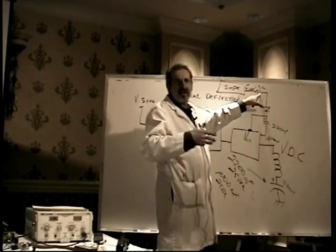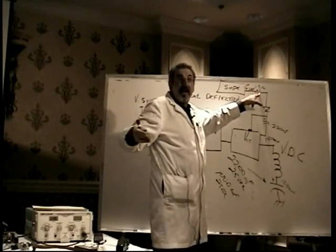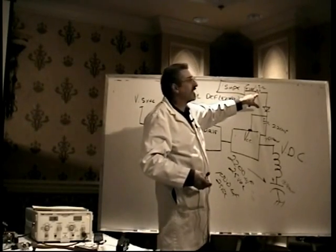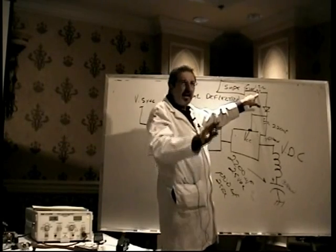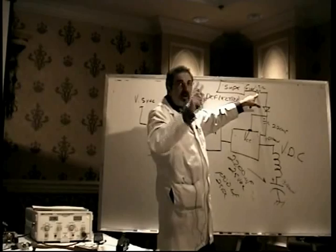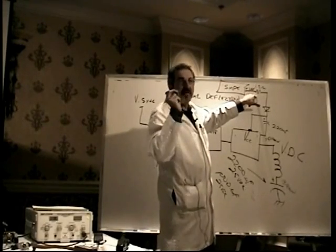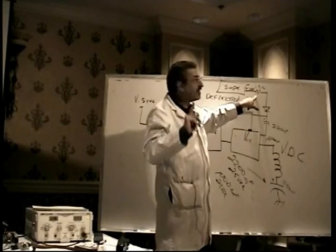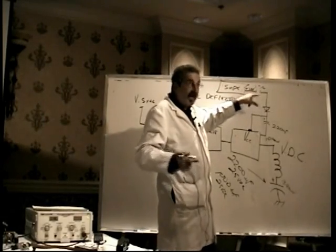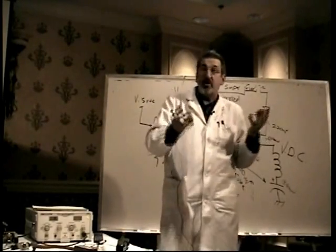This resistor is kind of a protection device in a way. It's in this month's Slot Tech magazine. There's a discussion of inrush current, and it protects from inrush current. And in a way, it kind of acts like a fuse as well. And this is where I'm going with this. Resistors, when they fail, either go up in resistance or open circuit completely. Typically, they open circuit completely. They can go up in ohms, but they never short. Resistors don't short circuit, they open circuit.